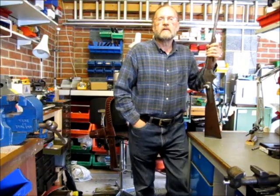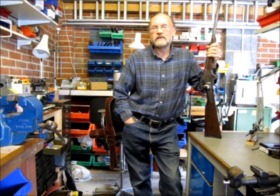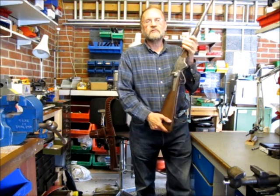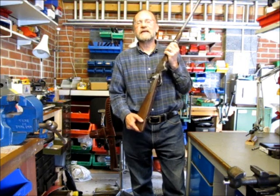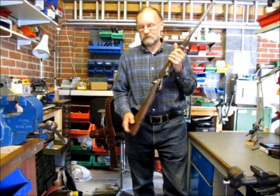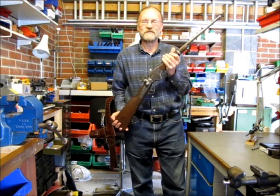Well, that's all for now. Thanks for watching and I hope you found something of interest. If I've been able to help get at least one Spencer back into commission then I'll be happy. A couple of points before I go: firstly, the original Spencer is going to be at least 140 years old, so before you even think about firing it, get it checked out by a competent gunsmith. Secondly, if you do the conversion, please don't forget to convert the magazine follower — six rounds of black powder going off in a chain fire one inch from your cheek is really not going to make your day.